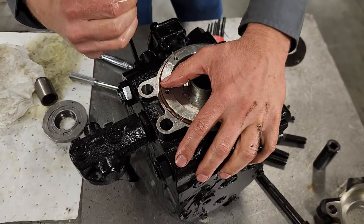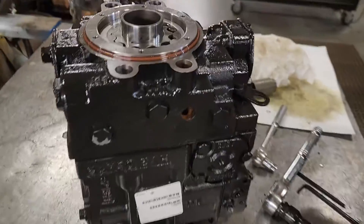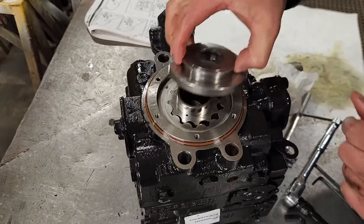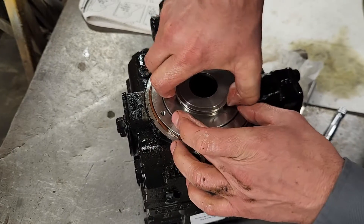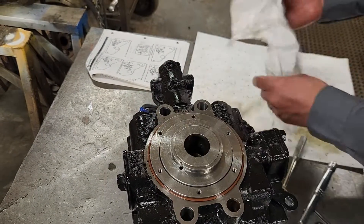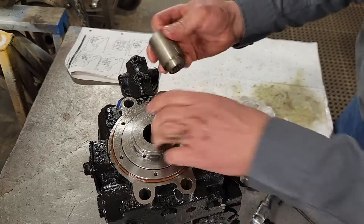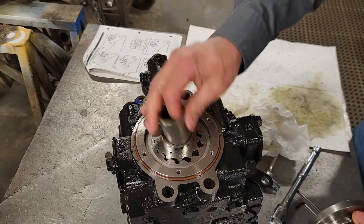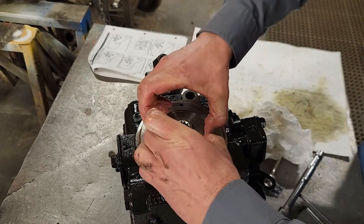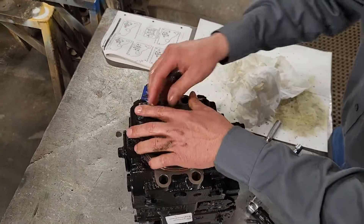I'm going to run these down basically finger tight, keeping an eye on my gap and making sure that it becomes fully closed without excessive pressure. I don't want to get that too tight because I have to wiggle things around some more. There's my hole — that's locked down inside there, I felt that go. Now let's put all our pieces in there: drive shaft's locked in, charge pump cover nice and clean, put it back in. I felt that go down — I can put my charge pump retainer plate back on now.